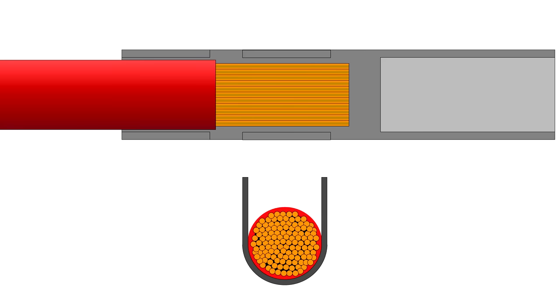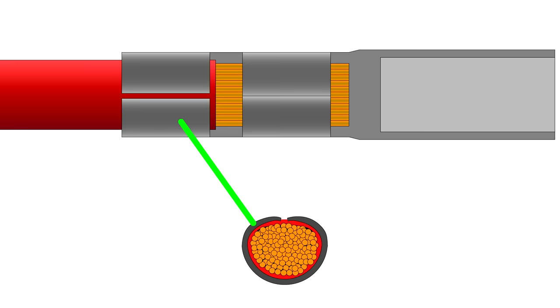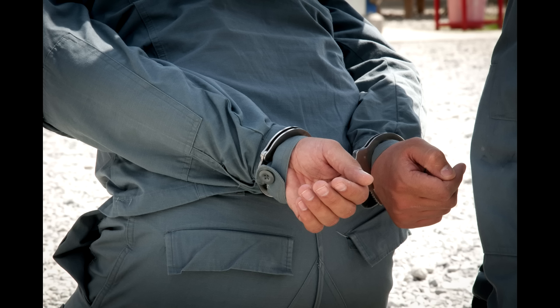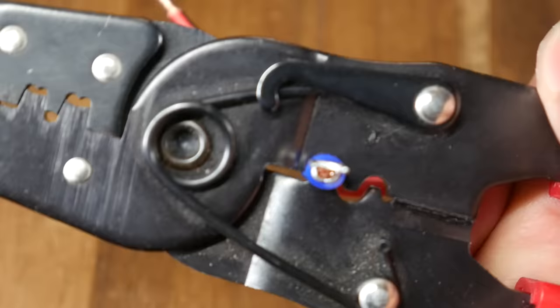Let's have a closer look at what's typically happening when we crimp a connector. We have stranded wire with the end of the insulation stripped off and we rest this inside the metal terminal. The process of crimping alters that metal terminal, with one part gripping hard on the insulation without damaging it and the section over the exposed wire curling down and gripping it tightly. If we hide the connector and look at just what's happening to the wire, we can see that the crimping makes narrow sections that act like a bottleneck — kind of like handcuffs, where we secure a narrow section and then the thicker section adjacent can't pull back through without something breaking. There are variations depending on which connector you're using, but typically it works out the same.